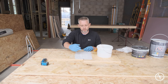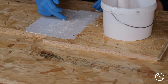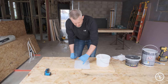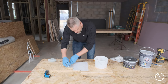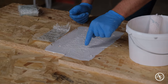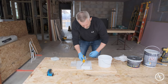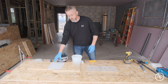Once the resin attacks the matting, test every now and again to see if the strands start to move. Go back over with the roller and look for a wavy pattern on the fibreglass — this tells you it's consolidated. If you take a dry piece of fibreglass, the strands are pretty straight. When you see the wavy pattern, those strands are breaking down and amalgamating into the system. Roll over it, take up any excess down the edges — and that's your reinforcement done.